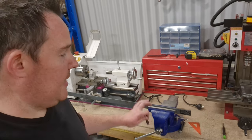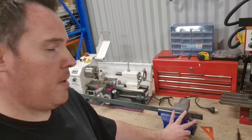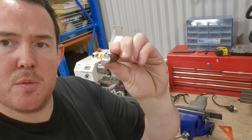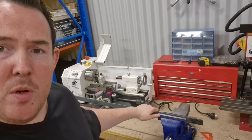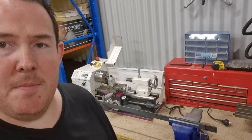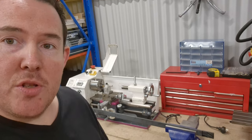Okay, so I've got some steel in the vise ready to cut. This is just 6mm steel plate, 30mm wide, and then I'm just gonna have the hinges hinge on this 12mm steel rod. You can have any shape you want, really, but I would recommend it being sturdy. I don't like opening those doors and feeling that they're flimsy, so this one's going to be nice and sturdy. So let's get these cut out, and I'll show you what they look like.